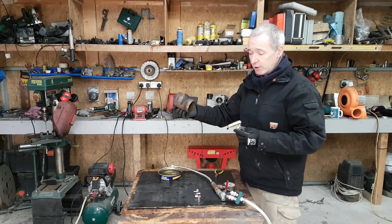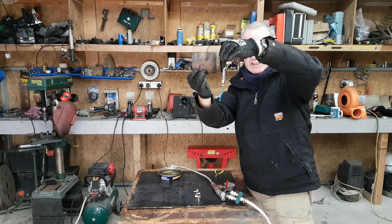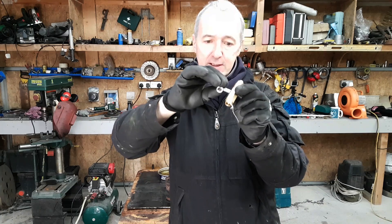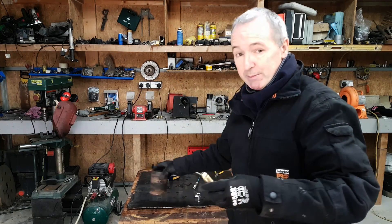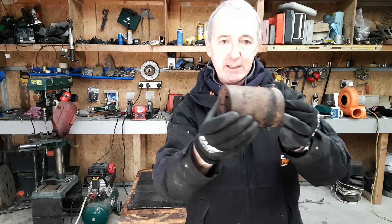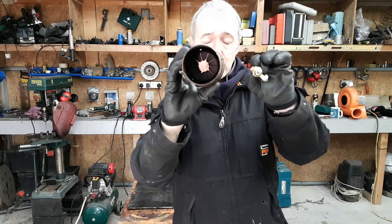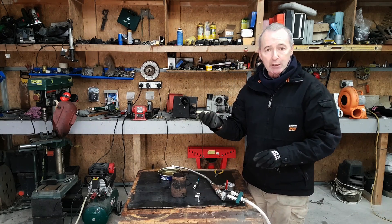This is the blast tube of these Riello burners. I need all of that to live in here, but I can't do it this way because that wants to stick out the side. I need it to travel parallel back to it. So the plan is something a bit different — I've got a 1/8 stainless steel male-female elbow that fits in there beautifully. That allows me to run two pipes — one feed, one airline — parallel, which gets me outside of this blast tube.